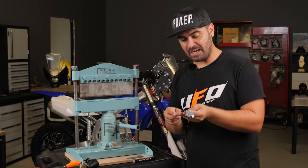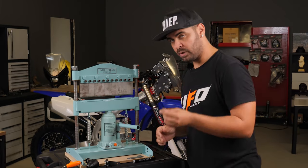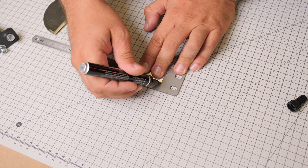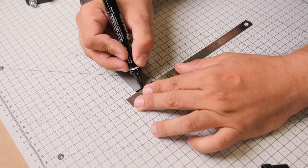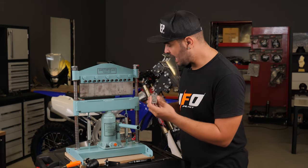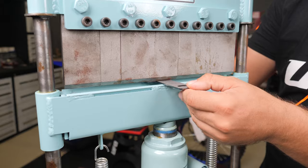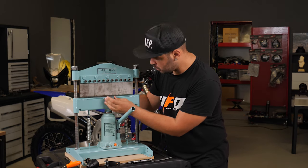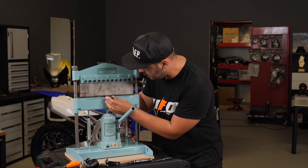First thing we do: we get this bracket and measure where the bend starts — it's at 6.5 centimeters. With my ruler I take the flat bracket, measure 6.5 centimeters, and with the black marker draw a spot, then a straight line. Once we've drawn the straight line on the bracket we put it in the bending machine and align the black line exactly against the angle of the punch. We place the bracket on the die and start bringing up the piston with the lever until we're almost touching the punch, then adjust so the punch goes right on the line.